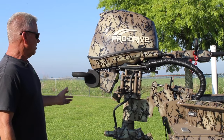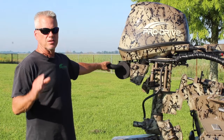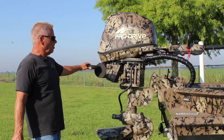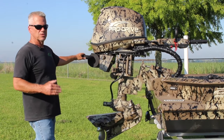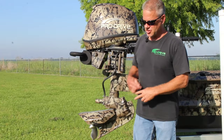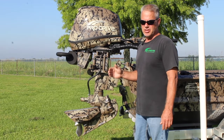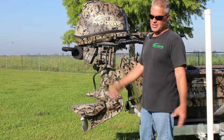It'll stop running when it needs to. So what this gives you is the reliability and instant throttle response. Not only is this sealed and protected from the elements, it's very quiet. We wanted to offer something that somebody could have — a quiet engine, reliable, covered from the elements, and was actually proven on water for years and years. Now, what you're eliminating with this engine is the flywheel fan on an air-cooled engine. That's a lot of your noise people don't realize — the flywheel fan spinning right by your head makes a lot of noise. Then you have your exhaust, which is as quiet as they can make them.